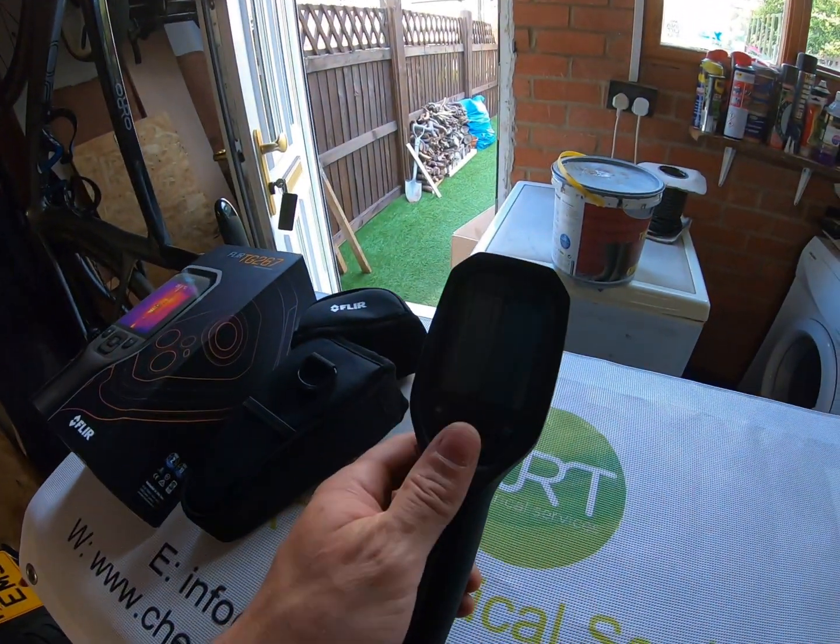For fault diagnosis and other things — like when lifting floorboards — you can use it to see if there are pipes underneath so you know when running a circular saw along the tongue and groove joint that you won't hit any pipes. It's not the cheapest; I think it was about £450–£500 from Amazon. But in terms of thermal imaging cameras and the quality you get, it's good value for money — some FLIR models like the E5 or E6 are a thousand pounds and upwards.